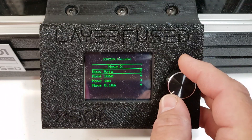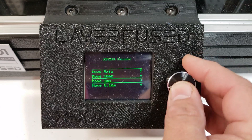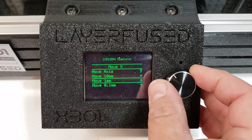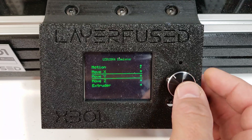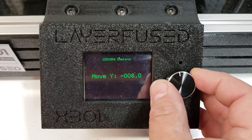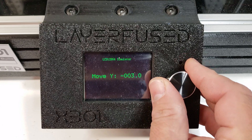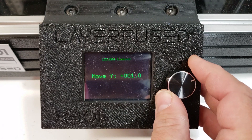You can also use the front panel to adjust where the print head needs to start printing. Note that this offset will only take effect when you're actually printing — when you home, it will still home off the bed, but once you start printing it will use this offset to know where the start of your print bed is. One restriction is that you have to be within 10 millimeters of the actual home position, otherwise Marlin will say you're too far from the home offset.